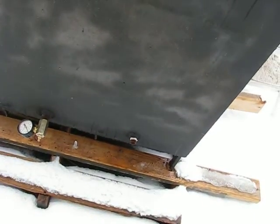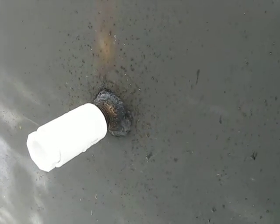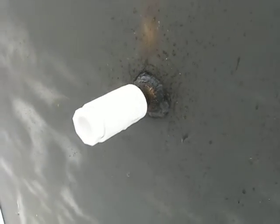And back here, that's where the hot water will come out. The cool water from the hot water tank will go in there. I also have basically just holes right here. This is plugged off right now when I was water testing, but basically that will be where the hot water will go out and into my in-floor heating or any heating sources in my house. It will return through one of those bottom ones. Anyway, that's it. Hopefully that helps explain a little bit more what I'm doing.